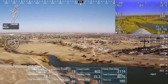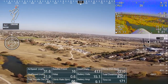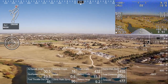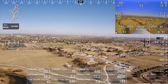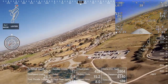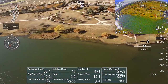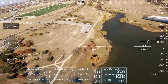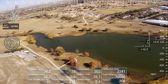I'm getting a little interference on my video feedback, which is at 1.3 GHz. Unfortunately, the flying field is right next to some very high-powered sprinkler automation transmitters, which occasionally interfere. Using the Dragon Link, just the right conditions in this park can give me a brief failsafe. But I've been out six or seven miles from this park with it, so not a big problem. Never think about the RF link when you're using Dragon Link.